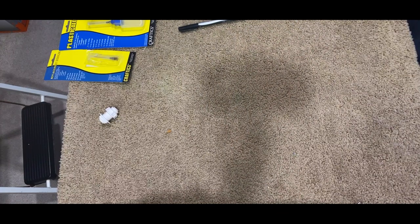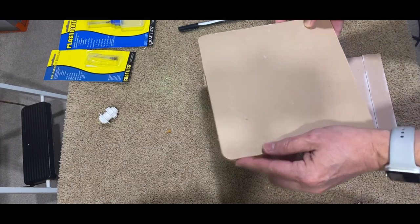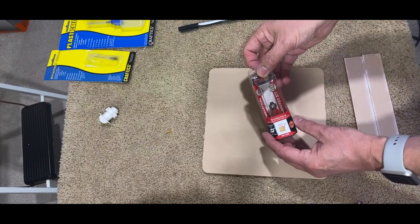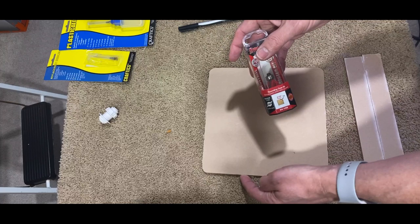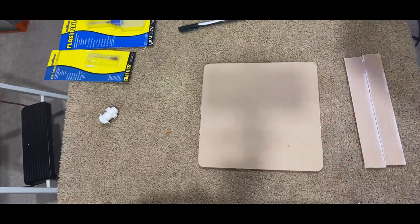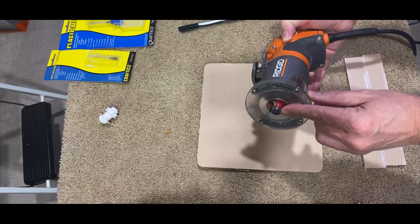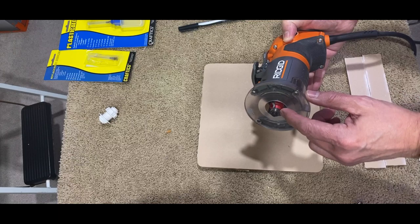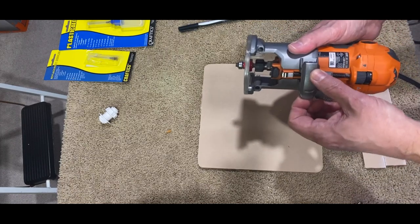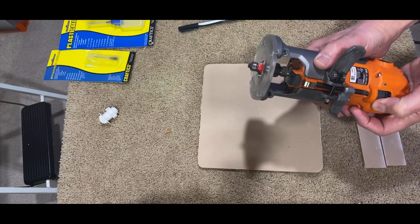We'll make a small skimmer stand for my tank sitter right now. Here's the piece that was cut out by Minion — I already rounded over the edge, that was done by the CNC machine, and then I took a router and went around the edge. The router bit I use has a bearing that traces the edge of the acrylic and the blade gives it that nice little soft bend. I use a handheld laminate trimmer for this. By adjusting the lever and turning the knob you can control how much of the blade is exposed, adjusting the depth of the cut.